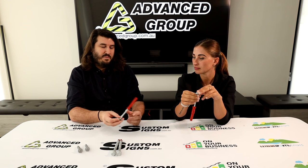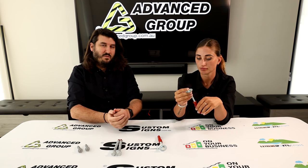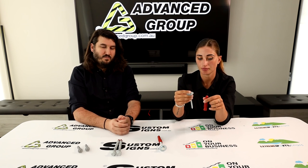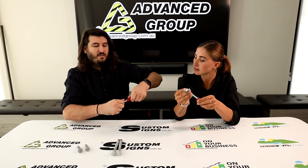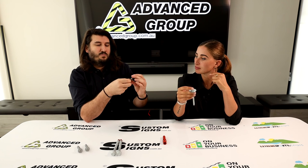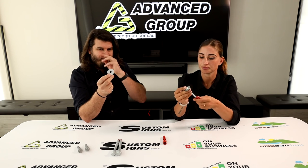These would outlast the speed hump with no problems. You'd probably get 10 to 20 years if immersed in water. Once you start getting into the decades when immersed in water, electroplated zinc doesn't last as long — the rust won't completely decay through the steel but it will get very rusty. The nylon anchor is 14 by 90mm, the coach screw is 10 by 100mm, and the washer would be an M13 inside hole diameter with probably a 35mm outside diameter — it's a bit of a rare washer.